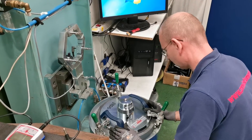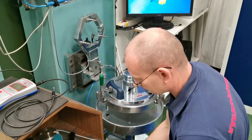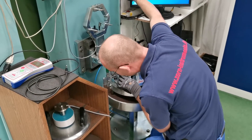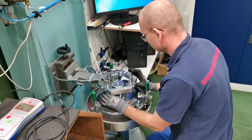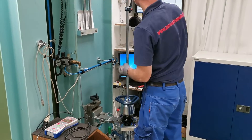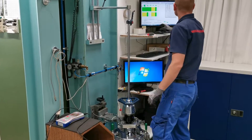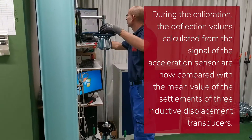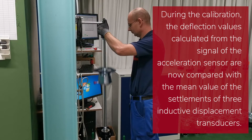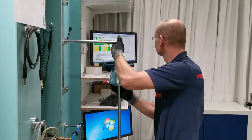To do this, the load plate is clamped onto the steel platform. A special flexible mat is placed under the steel table to allow a defined deflection. Then the displacement transducer bridge is folded down onto the load plate. The load plate is connected to the LWD electronics box and work can begin. During the calibration, the deflection values calculated from the signal of the acceleration sensor are compared with the mean value of the settlements of the three inductive displacement transducers, which measure the movement of the plate directly.